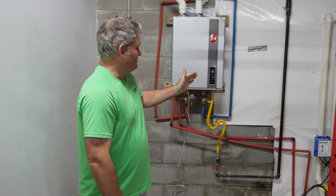So in that scenario, if you get a 9 gallon per minute or greater tankless water heater, you're probably in a pretty excellent situation — because again, that's assuming all of your showers are in use at the same time, plus someone washing dishes at the kitchen sink concurrently.